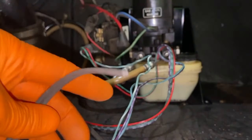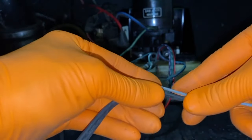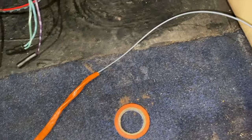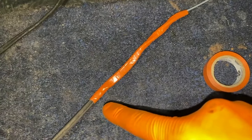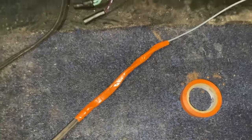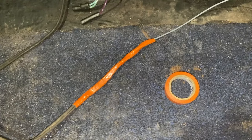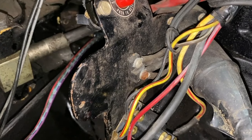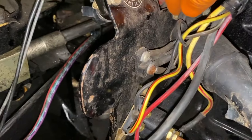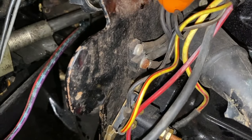Here is the opposite end of our wiring — I am now going to tape a string trimmer or weed whacker line to it. I wrapped about six inches of string trimmer line in gray into orange electrical tape. That trimmer line goes all the way up about six inches — the last thing I want is for it to come disconnected as I pull it downstream and out the back of the boat. I'll switch colors for the opposite side and do the same thing.